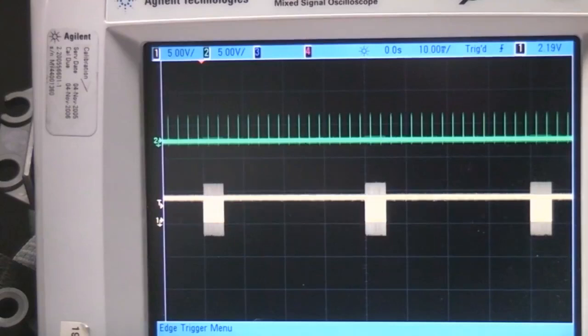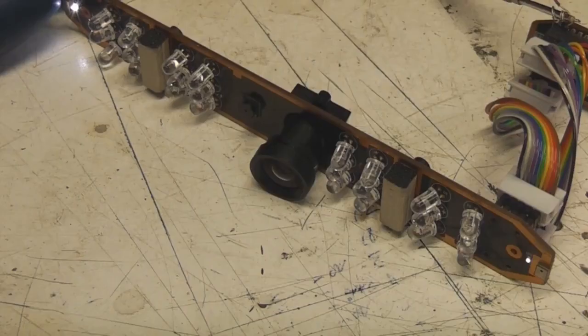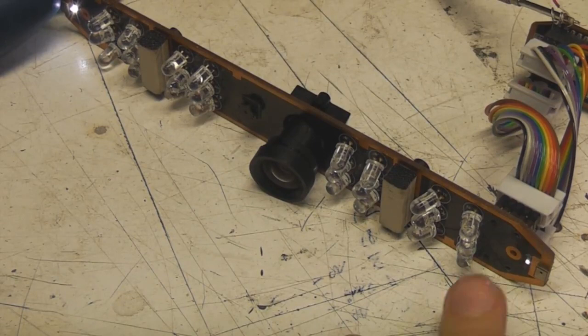Something I noticed: this white LED actually indicates the infrared power. If I put it onto full power mode it lights up brightly, and if you reduce the power it goes dim. These are also status indicators — if you disable the RGB camera you see that LED goes out, and if you disable the depth camera the other one goes out. So these are status indicators that also indicate the intensity of the infrared illumination.